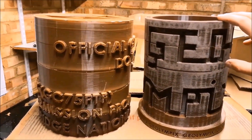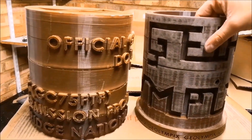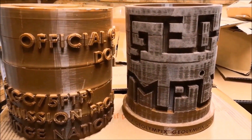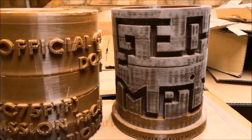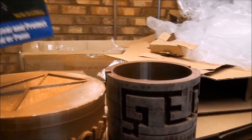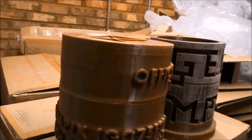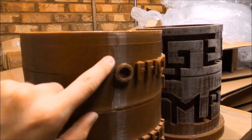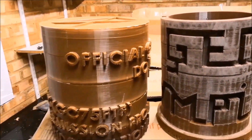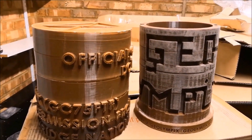So what I need to do now is clean up these pieces — a bit of soapy water to make sure there's no dust. Then using acetone I'm going to solvent weld all these pieces together and fill the gaps up. I've put some acetone and some ABS in a jar, which will dissolve into a syrup to fill up any gaps. Then a quick sand again to get any excess off. I'm going to go over it with some XTC 3D, which will make it a bit stronger and smooth out any print layer lines without having to sand. After that I'm going to spray paint the outer parts so from the outside it all looks like one colour.